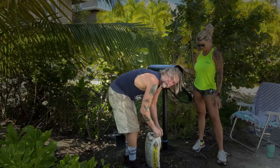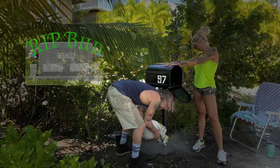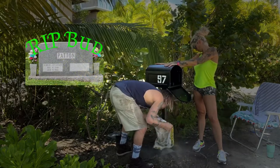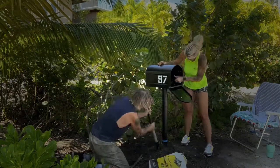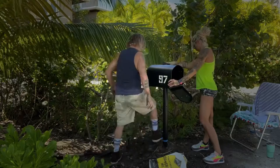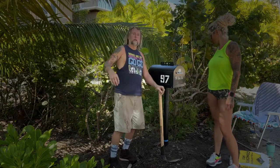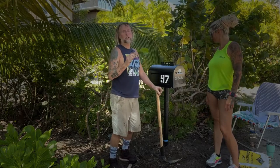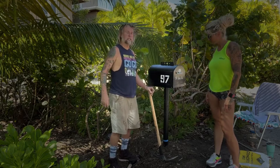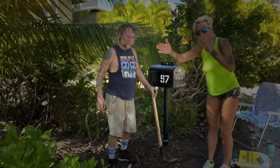What we're going to do is just pour the dry concrete in — no water, no fuss, no mixing, just pour it in. There's going to be a lot of burying, just pouring it in the ground. The secret about this sack-crete is it's going to set with the water from the ground. That's how you do it: dig a hole, put the pole in, get it straight, level, and square, lay the sack-crete in, cover it up, let it set up overnight. Appreciate you — come back anytime, subscribe!